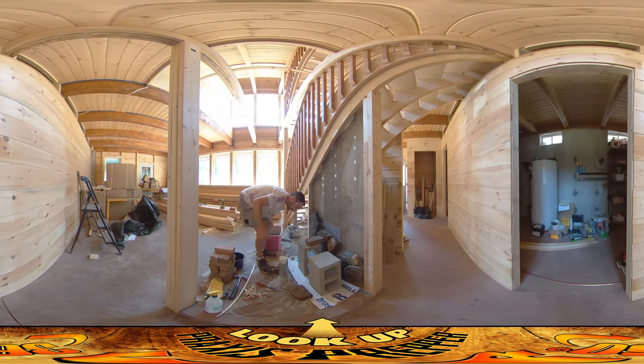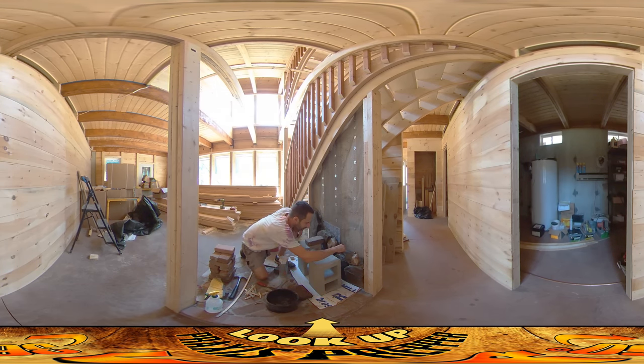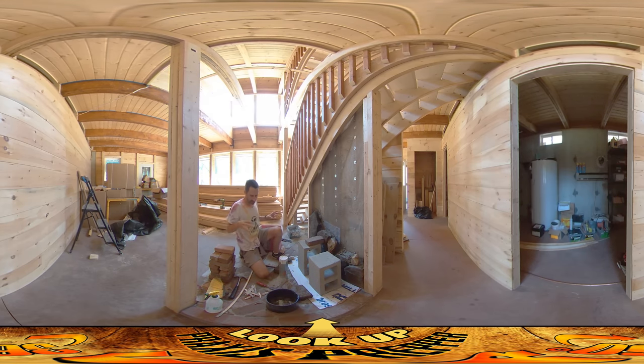The next thing I'm doing is I've got some little pieces of gravel — I've got them in this little pot with some water — and these are just being used as spacers so I can set them down into the cement. That way you don't have the rock directly on the rock below, and the reason for that is mostly just cosmetic. I'll put a little bit more cement on top of those because the stone is going to have spaces on the sides, and it's nice to have spaces above and below as well.